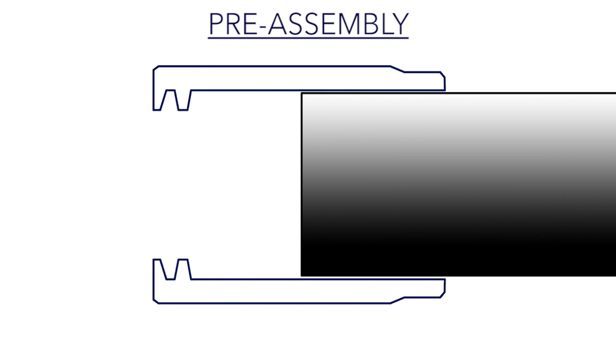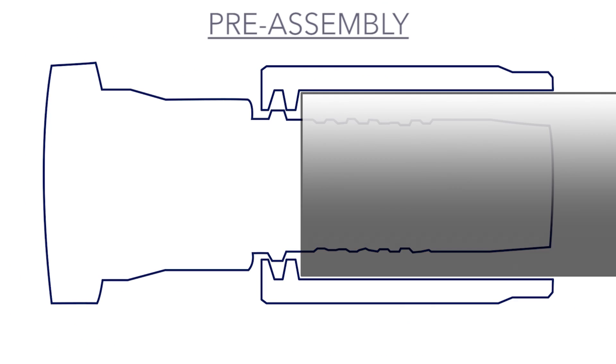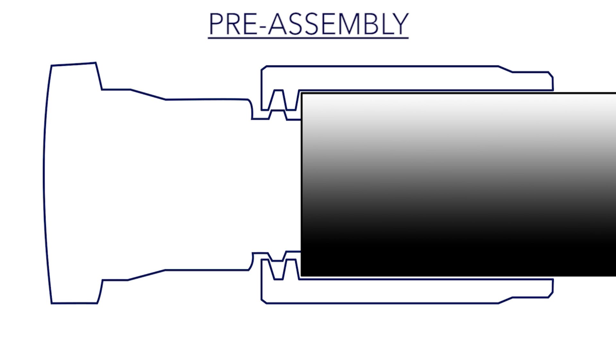Make sure that the fitting is positioned correctly and that any interlocking parts have a correct pathway to each other. This will stop the fitting from pushing out when swaging and also keep the fitting sealed under pressure.